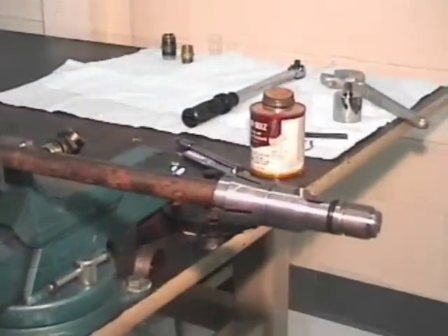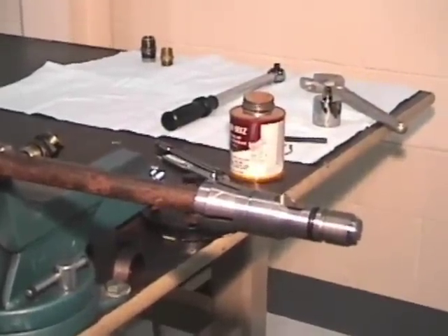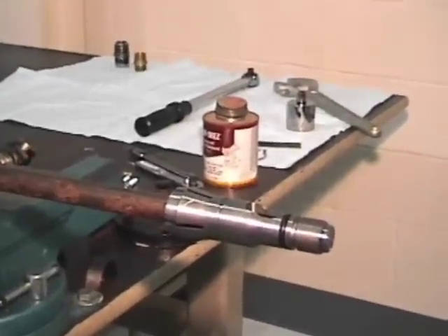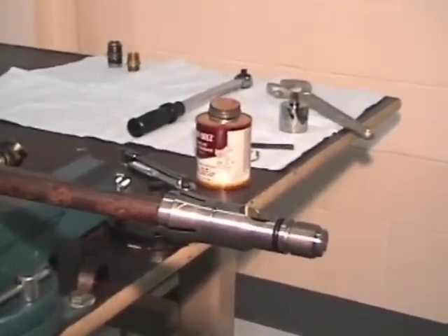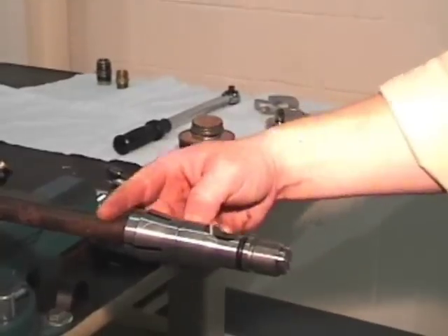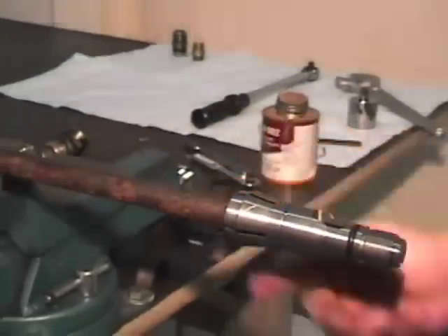This is the procedure for assembling the entire joint and siphon as a single unit. If it is not possible to insert the assembled siphon pipe into the roll, the siphon and the joint may be required to be installed separately. We will need to make some notches as a reference point to establish the correct 6 o'clock position of the siphon.